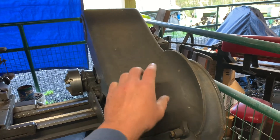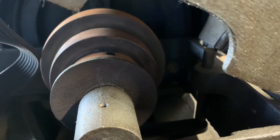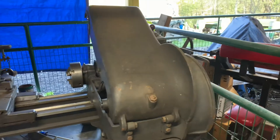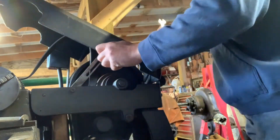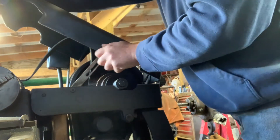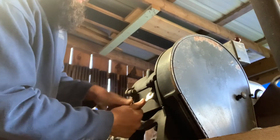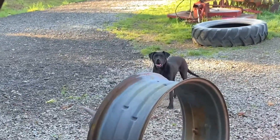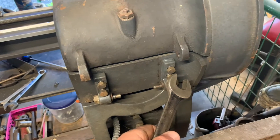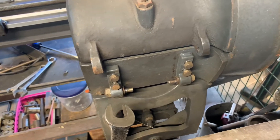You can call this the shield, but it is also the belt tensioner. If you look back there, that little mechanism — not on the left where the belt rides, but on the right — pushes that rod down, and that mechanism basically spreads those apart and tightens that belt up so it can spin. We're going to go ahead and take that off so it's a little easier to get to all this. Now that we have the belt tensioner brackets off of the tensioner, all I did was flip them around and put the bolts back in loosely so you don't lose any bolts.